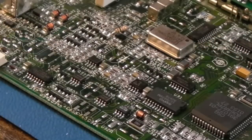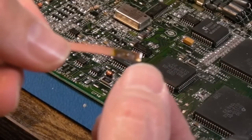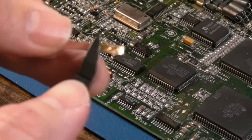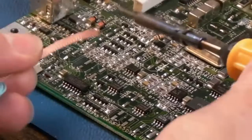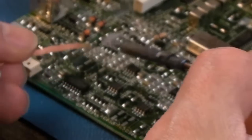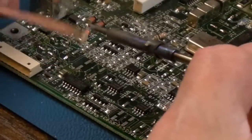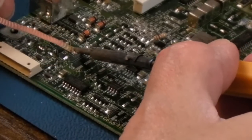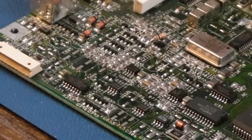Yeah, it needs cutting back a bit, the braid. You know, to solder braid, as a capillary reaction, the solder will suck up so far, but then eventually you get to the point where you have to cut it back. Or use it further back, but then you get solder everywhere if you're not careful. Yeah, its capillary reaction will stop working as well as it gets saturated with solder. Anyway, you get the idea, so I'll perhaps report back when I've done this.